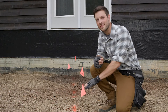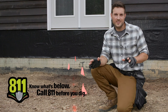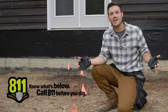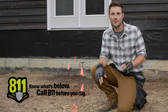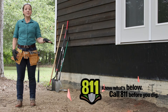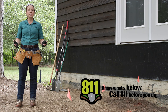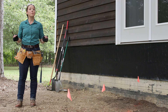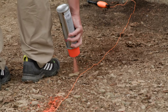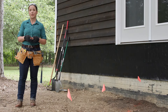You've probably noticed the orange line and these orange flags. Anytime you're going to be digging on your property — in our case, digging the holes for our footings — we need to know the location of our underground utilities. This service is only for public utilities like water, gas, electric, phone, or other communication systems. If you have private utilities like a well or septic system, a private company will need to locate those for you.